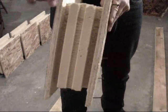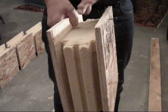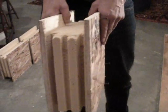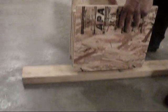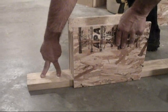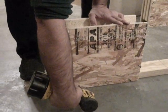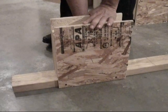This wall will give you an R32. A two by six wall, at best, will give you an R19. The panels come pre-routed for splines, and top and bottom for attaching the top plate and the bottom plate. The panel is brought over to the home, put onto the bottom plate which is attached to the foundation, and then screwed to the plate on both sides.